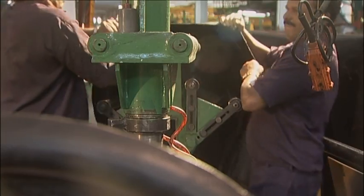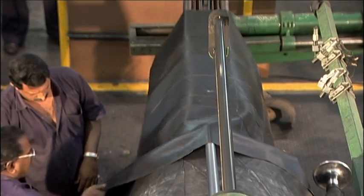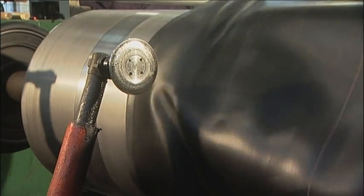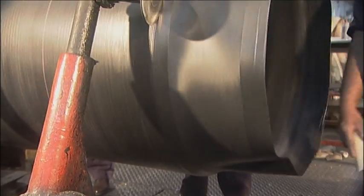It is at this stage that all the component parts of the tyre are assembled. The flipped beads, the pockets, the tread, the side walls and the chafers all come together on the tyre building drum. Each pocket is centred on the drum with the help of a laser. A thin coating of stearic acid reduces friction and helps align the pockets.